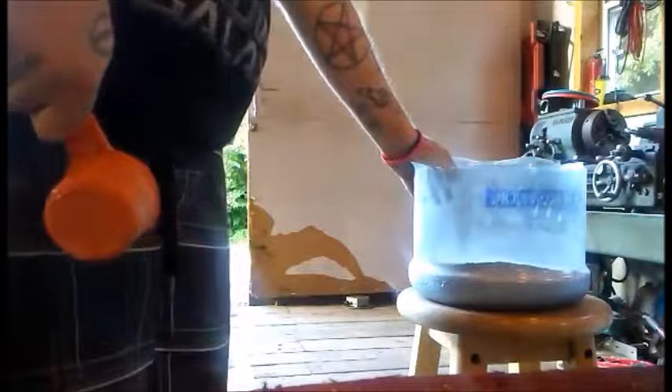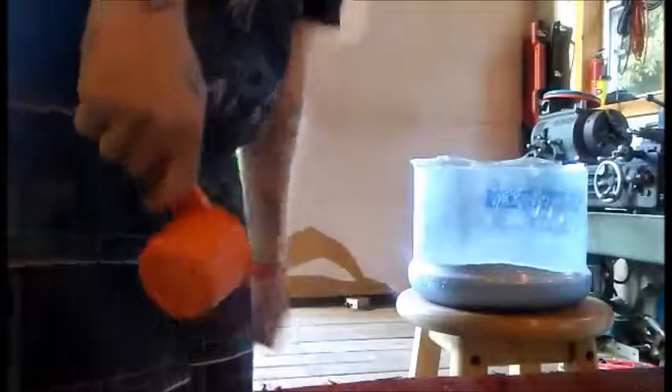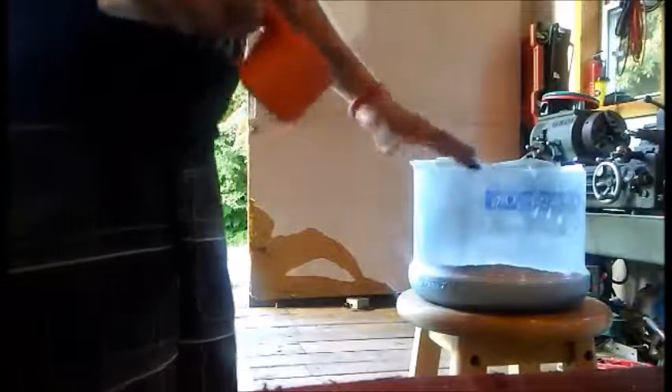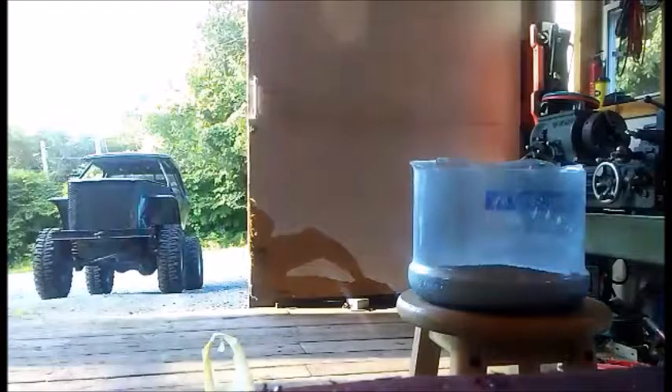For this half recipe we're using 10 cups of plaster of paris, 10 and a half cups of play sand, and seven and a half cups of water, which I've got pre-measured out into a jug. It's okay to get your sand into your plaster of paris right away, but once you add the water you've got about 10 minutes to stir before it really starts to set. You want to get it stirred up as smooth as possible with the smallest lumps, then get it poured into your can and move on to pressing the form in. I'm going to cut away while I measure this out since I'm running low on battery.